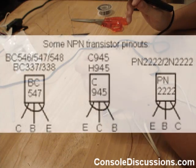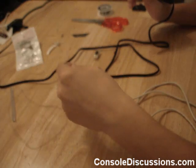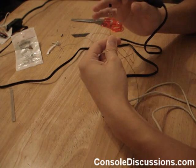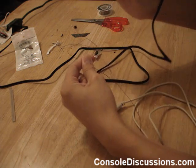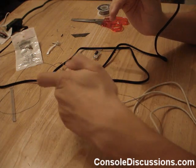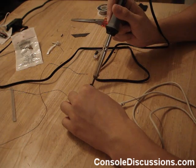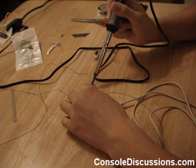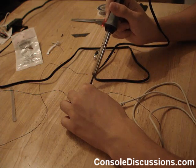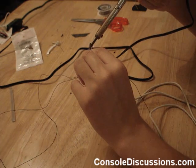The next one is the collector - that's where the 1k ohm resistor goes. I've already got it attached to a wire with solder on it to save time. If you look at the picture you would know the collector is right here. Once you're there just solder it together - set it down to make it easier, because if you hold it it's going to get hot pretty quick. Do it as fast as you can and just tap it.